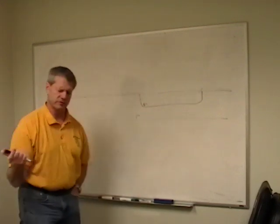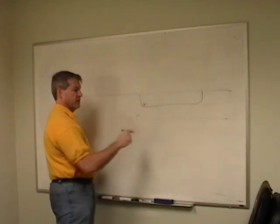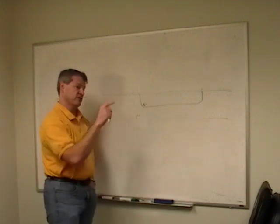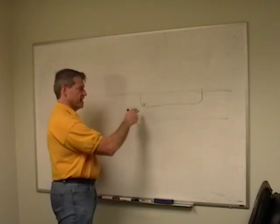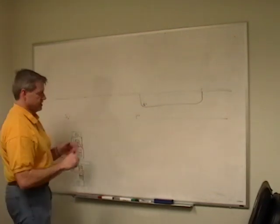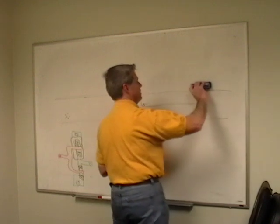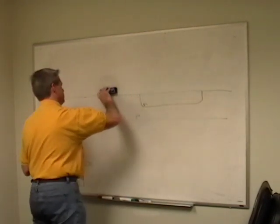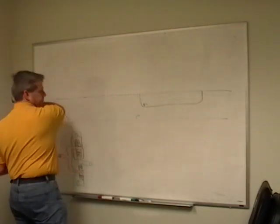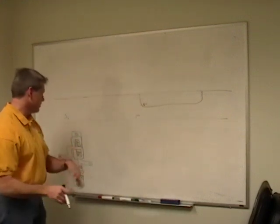One of the questions I had was, well, what happened to all the ions that were in here before that made this P plus? Well, they're still there. I've put enough of this new ion in there to overcome that, and overcome it so far that it becomes an N plus. And so we do these stages again, right? So now I'm done with this, and I'll go clean off my silicon, and I'll do another etchant layer, another photoresist layer.